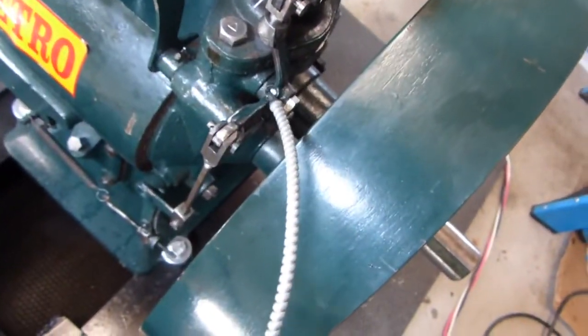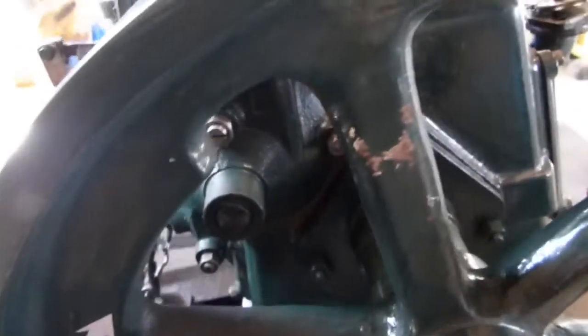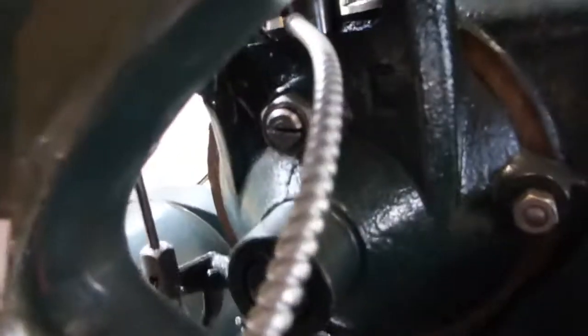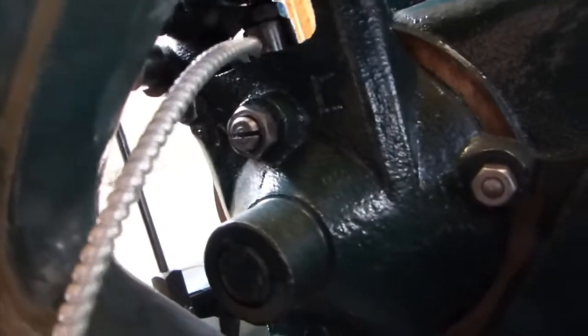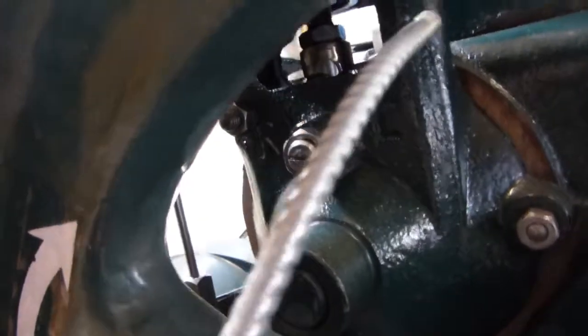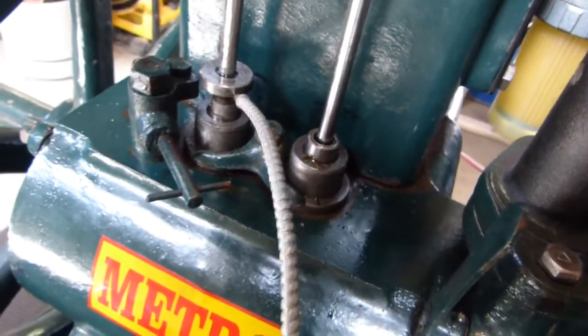Then you come over here, send a shot into here. The linkage on that's pretty good. Let's see if I can rotate this just a touch. You got to get your clearance into the injection pump right there. I have a lousy angle for that. Let's see. There we go. So you can see where the injection pump is. Just run a little bit of oil on there. Perfect. A little bit around here. One, two, just a touch.